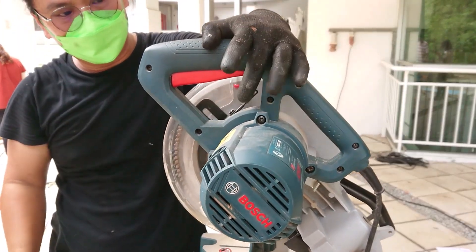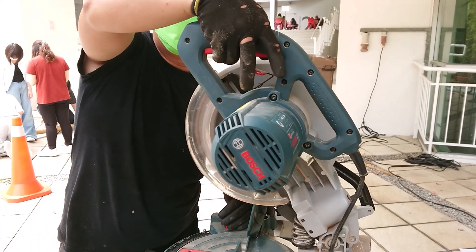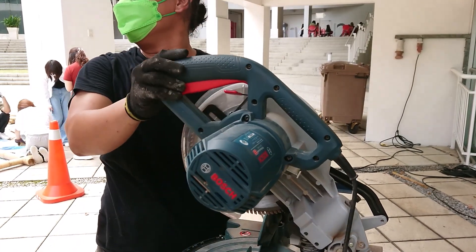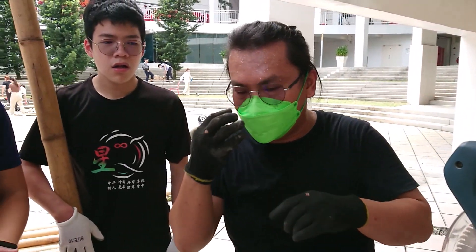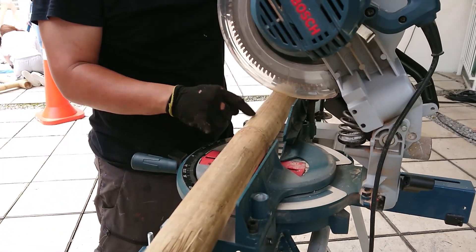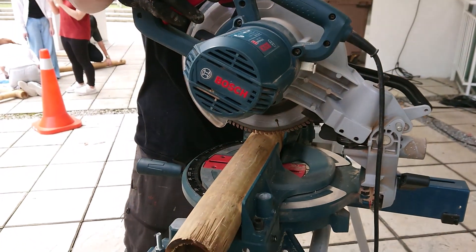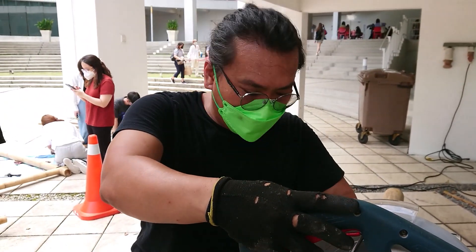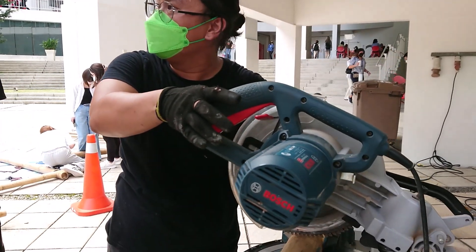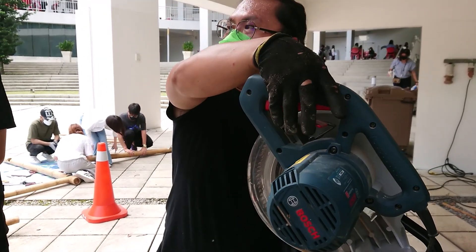So how I will use it: I'll put the material there and press. Don't ever do this — come down then only start. Start, then only open safety. Two reasons: number one, where's your cut? Here or here? Once I put it, if I use the safety like that and cut — never ever start the saw when the blade is touching something. You must start the saw when it's free. If you start the saw when it's touching something, you'll kick, break the blade, break the bamboo, and it might hurt yourself. Don't do that. Remember step one: firm grip, trigger, then safety.